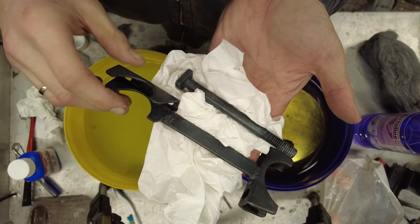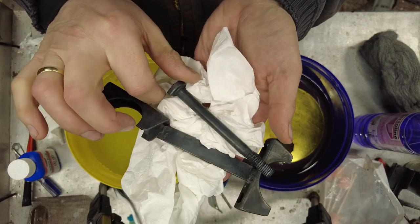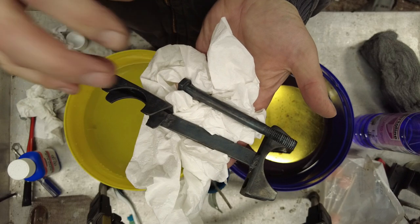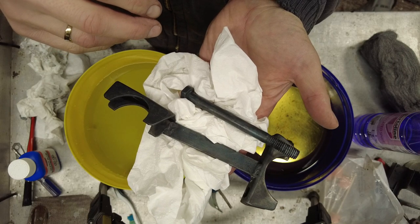So we've got both of our parts — they're both a dark blue-grey colour now. It gives you a matte finish when it's all dried off. What we're going to do now is pop them in the oil so the oil can penetrate the surface a little bit and protect them from moisture for 24 hours. We'll come back and see what they look like.